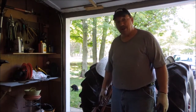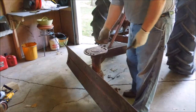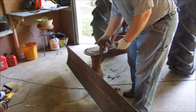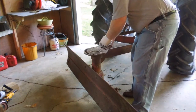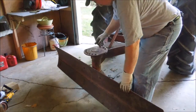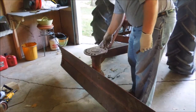When I did that I put an awful load on this back blade. When I was pushing all that heavy snow I broke out this bar and this tube that are supposed to be there to hold the plow in place. This pin goes down to that plate and keeps the plow from pivoting. With that broken, the plow was kind of flopping around but I was able to get through the season.